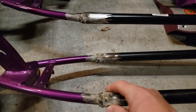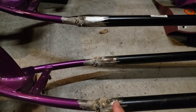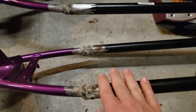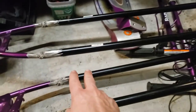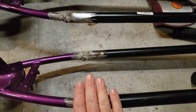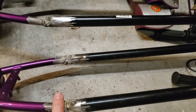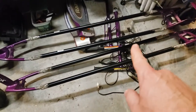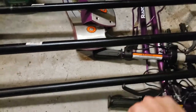Four plug welds, because the frame tubes come to about here, a little bit past the plug. The main thing about these two frames is measure, measure, measure — making sure everything is flat, square, and both are built exactly the same. They were within an eighth of an inch of each other. It's a lot of back and forth — measure, measure, measure — then tack weld, then weld up. So yeah, these two pieces are nearly identical. The next step is to figure out the width and all that stuff.